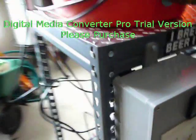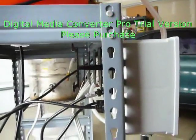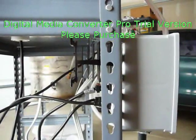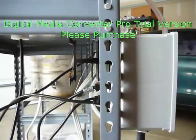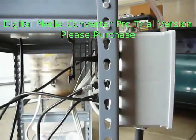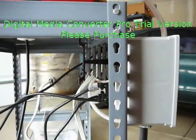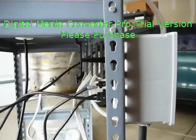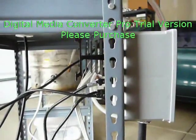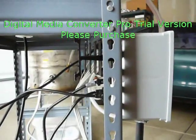Around the back here, you can see the heat sink that protrudes from the back of the control panel itself. It's a 40 amp SSR inside there with the heat sink, and it's really only handling about 23 amps, so it should run pretty cool. Run a few tests and it only gets just warm to the touch. The internal temperature of the control panel doesn't exceed the ambient air temperature by more than 5 or 10 degrees as well.